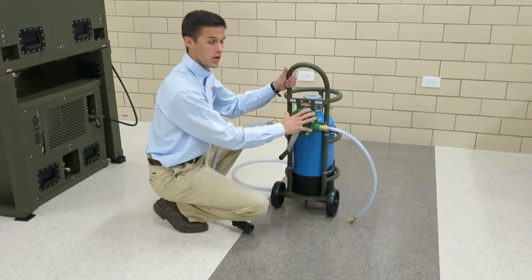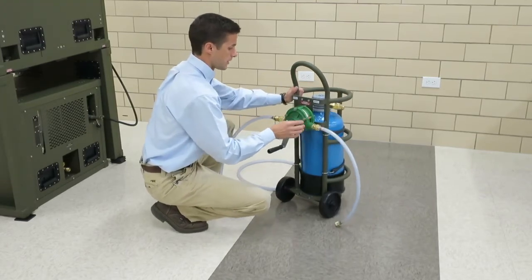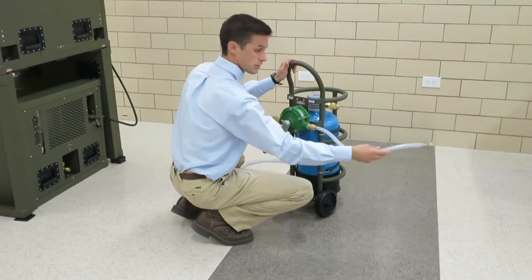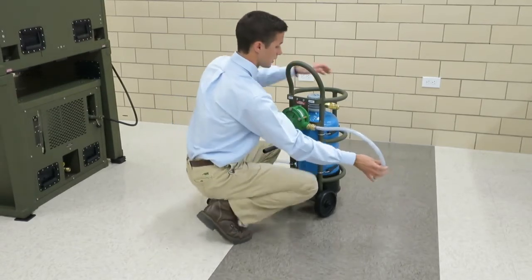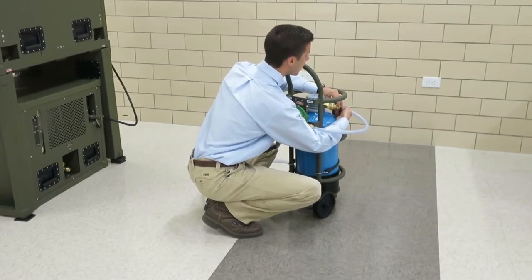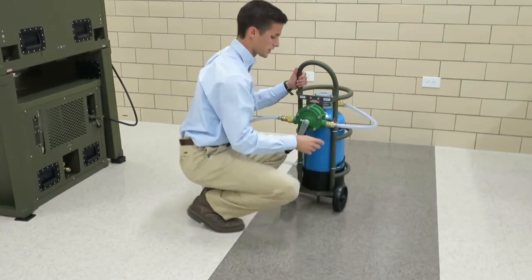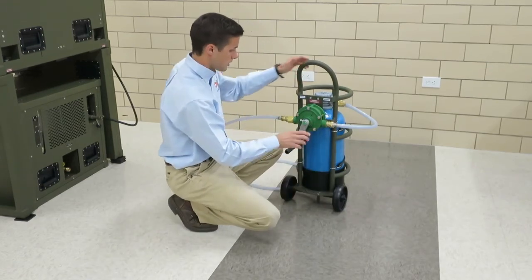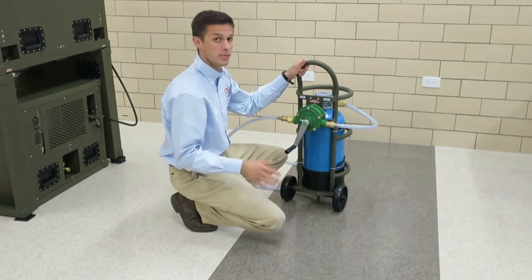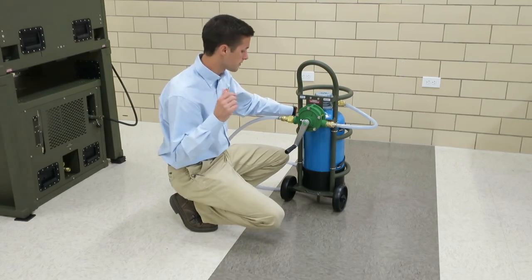You're going to use the manual pump. Just pump this clockwise. We've got the suction side, the discharge side. You're going to use this little hose supply to connect to the inlet of the vessel. Again, it's just a little garden hose connection. And you're just going to use this to manually pump water through the softener into the water recovery system.